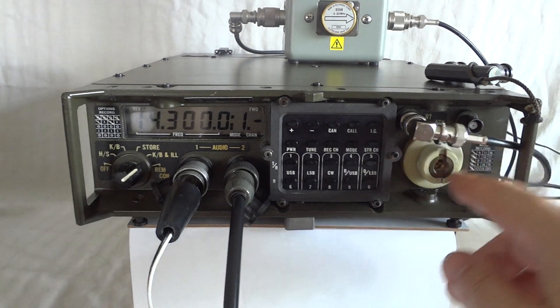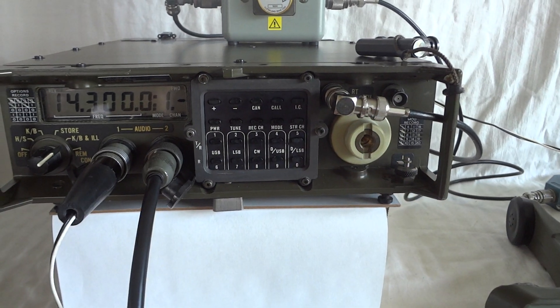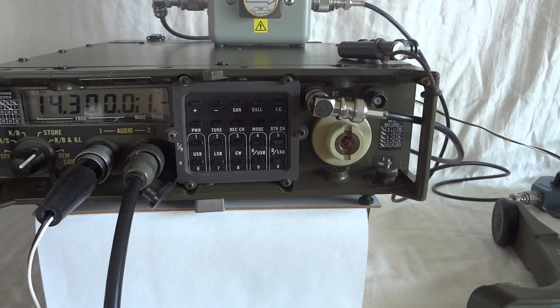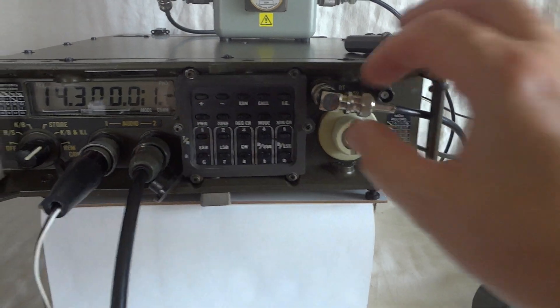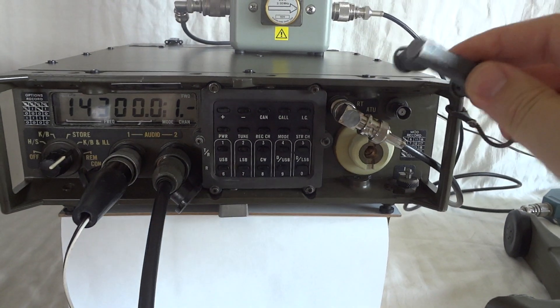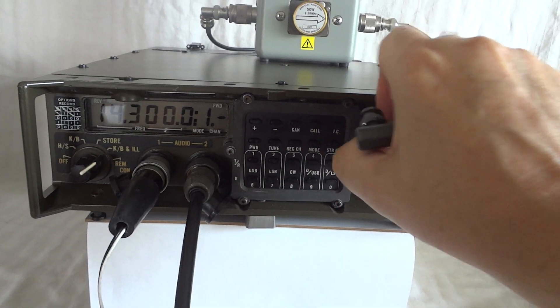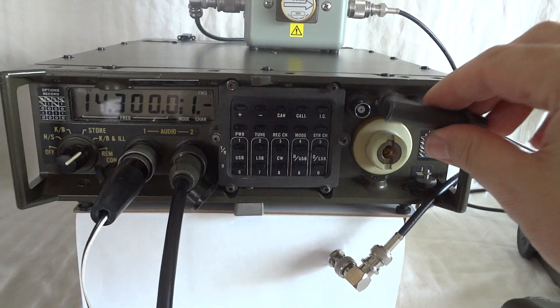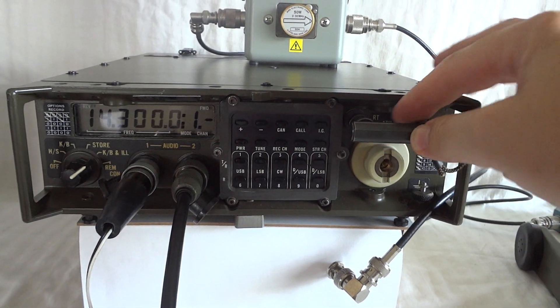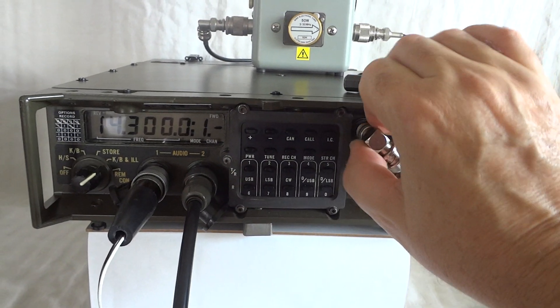The radio does have a built-in antenna tuner. You can connect a wire antenna here — the manual explains the length you need for that. Right now we have it hooked up to a normal 50-ohm output. If you use the antenna tuner you need to remove the external antenna and put this BNC jumper on there. Right now we're using it with my external ham antenna.